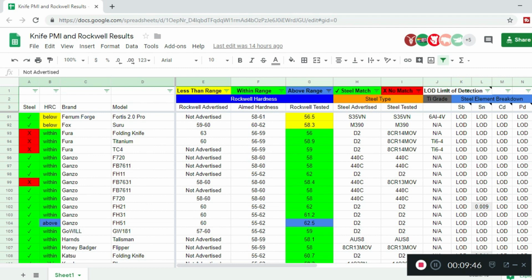And as I think in Steve's thing, he puts it into food terms. So the steak is like muscle, so when you heat it up and you cook it, everything kind of tightens up, and then you have to let it rest, and letting it rest is that tempering where you take it up to a set temperature, and then it lets everything loosen up a bit. So that's where there's a heat treat, and then there's a tempering. So this is probably heat treated, and then it got to that 62, and they probably didn't temper it.